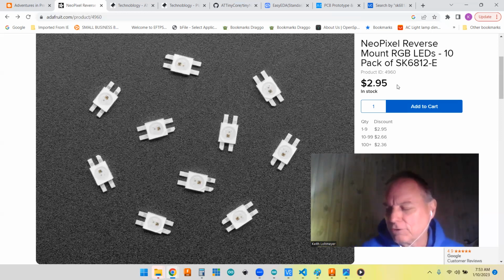I usually do these sessions totally as a volunteer. I supply all the materials and the equipment and everything. Most of the past boards I've made, and the Christmas trees that I just showed you, work off of a 9-volt battery, and I supply batteries as well. The cost of 9-volt batteries can be quite expensive on their own. So I'm thinking of a project with the ATtiny85, some NeoPixels, and a little buzzer for some buzzer music. The good thing about the NeoPixels is you only need 1 pin, and the buzzer only needs 1 pin, so the little ATtiny85 would be a great choice.